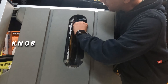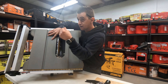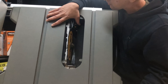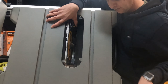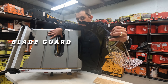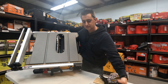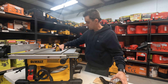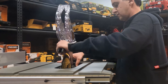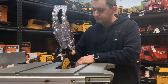There is a little knob here that you'll want to loosen, and then if you push it in a little bit it takes the tension off and the splitter will slide out — it's spring-loaded. You're going to replace that with the blade guard, which uses the exact same fixture. Push it in, get it in there — I'll lay it down to slide it in easier, then stand it back up. There it is, nice and simple, totally fixed. When you're done, spin that knob and tighten it back down.